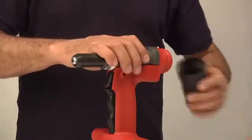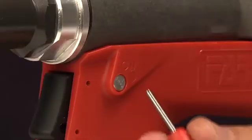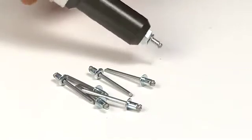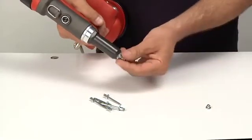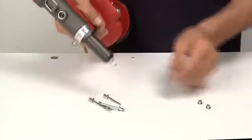Mount the nail container. Start the air suction, making sure that the selector switch is set to on. Introduce a rivet of the same size of the nozzle and check the suction is working properly. Run a few test cycles by tightening a few rivets to check the operation of the riveting tool.